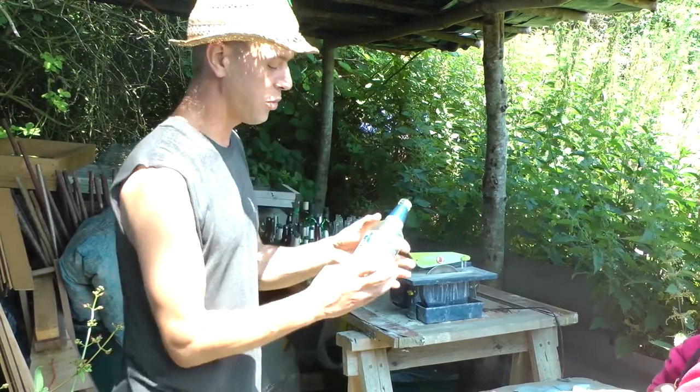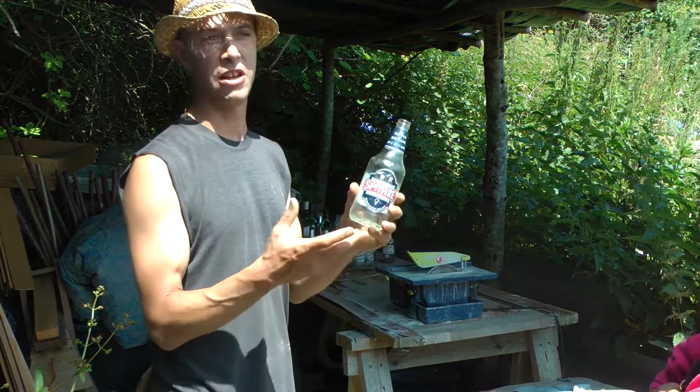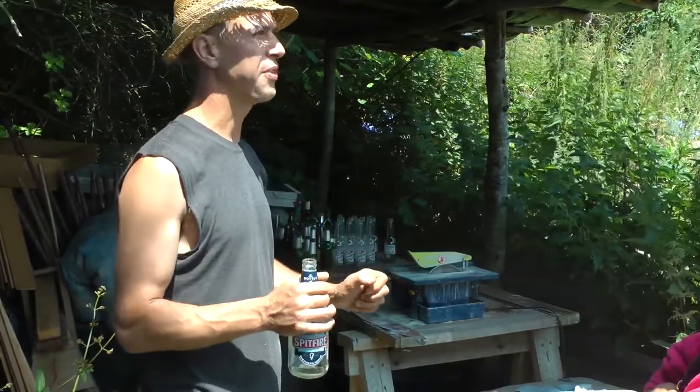Whenever you're working with any material in building, whatever you're doing with it, you really want to understand the properties of that material. So glass, in its pure form, is clear, and that's why it's stronger. It's more crystalline structure when it's clear. So that's why you can have really thin milk bottles, for instance. They're clear. Or at the opposite end of the spectrum are champagne bottles, really full of pigment, which have to be quite chunky and thick. It's not as strong when it's got loads of pigment added into the glass.